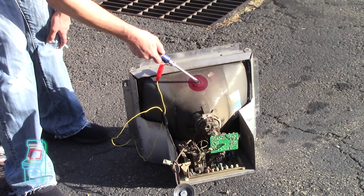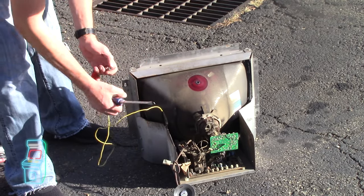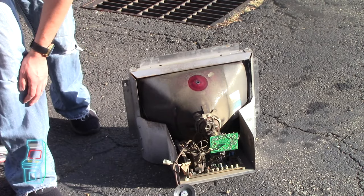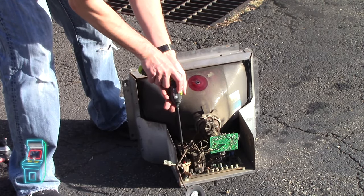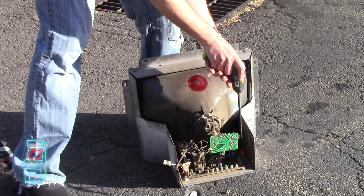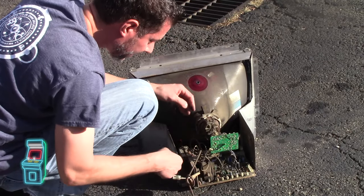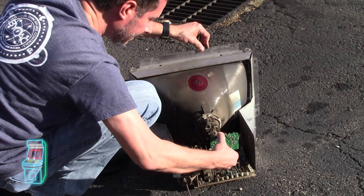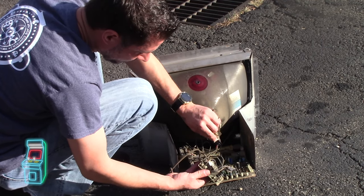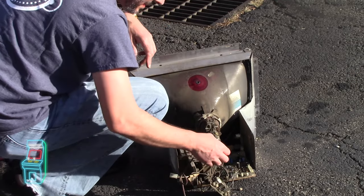Right here, water can get in there — that's not a hole, it's not going to get in the tube. This is a vacuum tube, which means no air is going to get in or out. So it's okay to do. K7000s are super easy — you just got to do those two screws right there. Let me take off the neck board. This has been worked on because it was glued, but the glue was cut through. I'm going to cut that off when I do it, just to make it nice and neat.